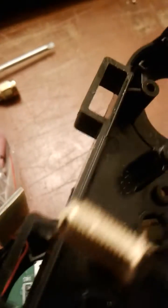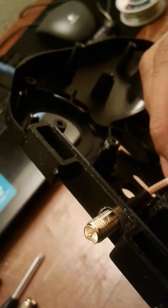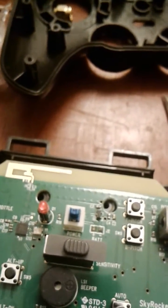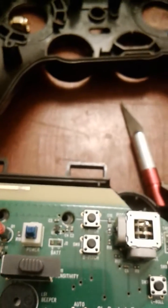The antenna will go right in here. I smoothed it out so it looks nice and neat. There's a piece that goes right on top and holds it down — that'll look clean. I'm going to solder it and show you. I can't film while soldering, but it's pretty much: tin the coaxial wire and solder it to the point you scratched on the antenna pad.